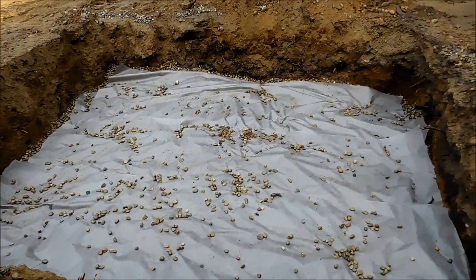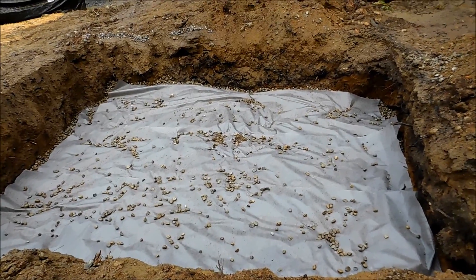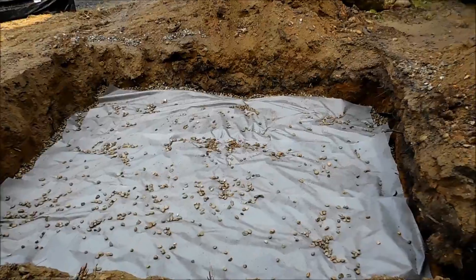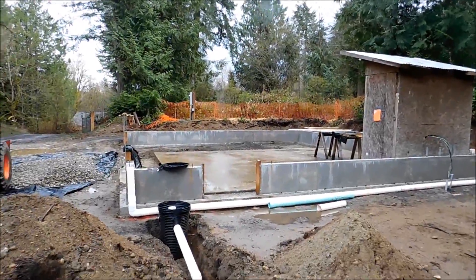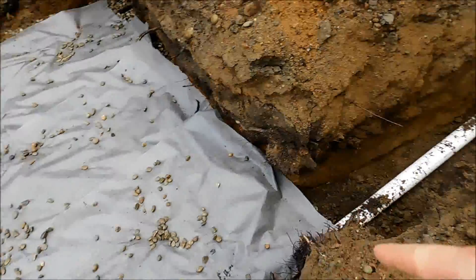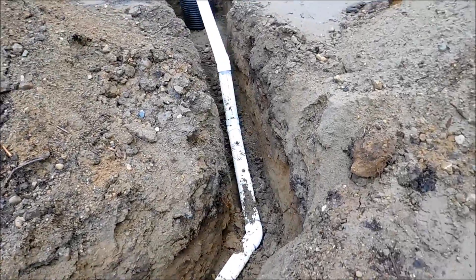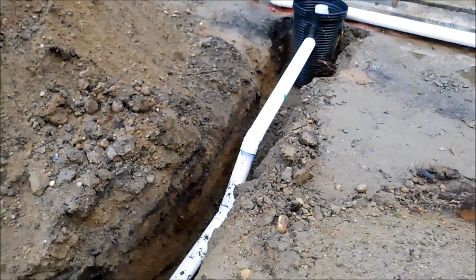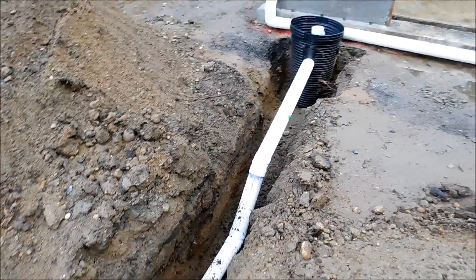The infiltration pit is sized by the county and your site development people. This was sized for my shop, which is going to be 28 by 32. From the pit you will see the 4-inch pipe runs up; in my case I put a 45 right there, came up, and in order to make it into the basin I put a 45 here and came up and 45 again and came over into the basin.